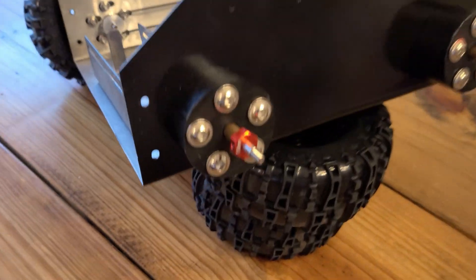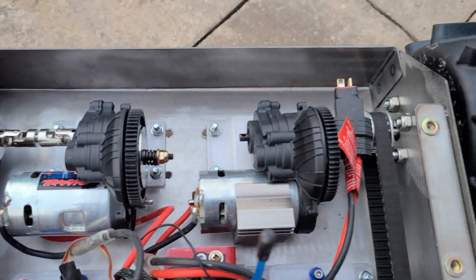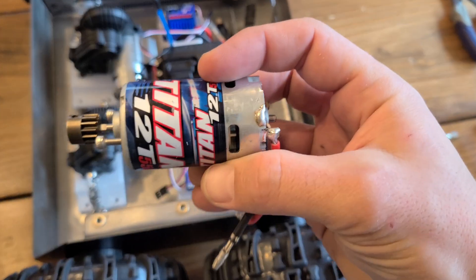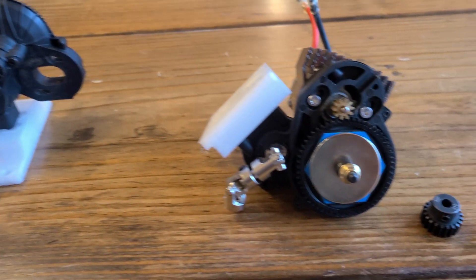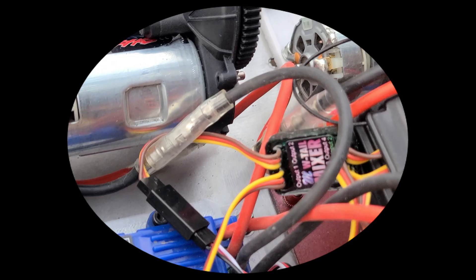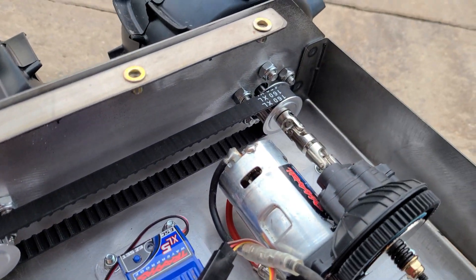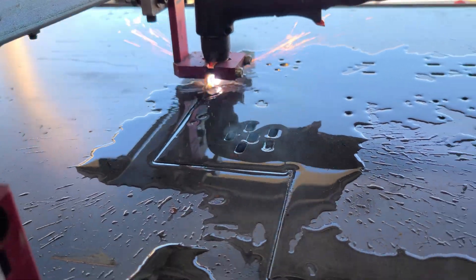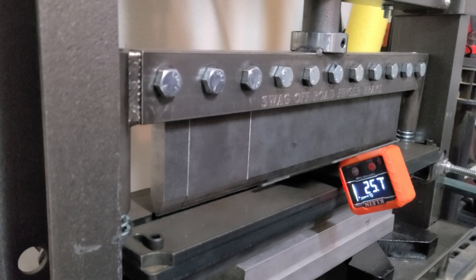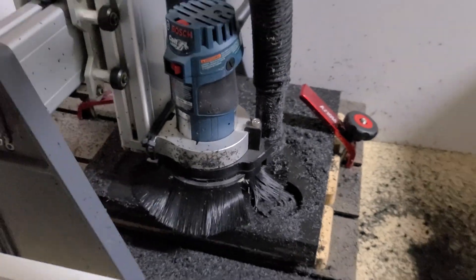One of the keys of the design is that it uses dedicated bearing hubs to ensure the motor and transmission don't ever see any impact or high vibration loads. The power plant is two Traxxas XL5 setups with dedicated transmissions that allow me to change gearing as needed. I'm using a signal mixer for differential steering, and the wheels on each side are joined together with a belt drive system so I only need to run two motors instead of four. This thing was really cost effective because I could fabricate the chassis out of sheet metal on my plasma table, form them on my hydraulic press, and machine the bearing hubs myself on my CNC router. The miscellaneous brackets could all be 3D printed.